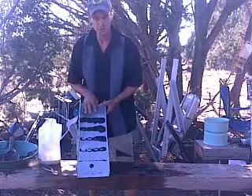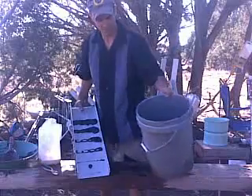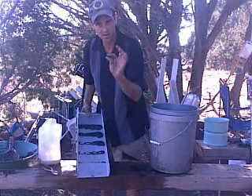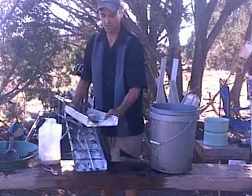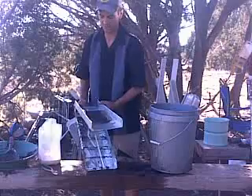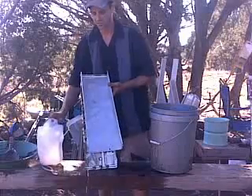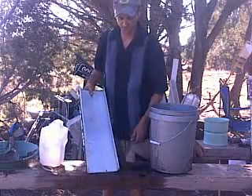This will help remove most of your black sand. The easy part: to remove that black sand and wash it out, you take the top magnet that's holding it together off, then lift the top and bottom plates from each other. You'll notice they separate and it takes very little water to wash it all clean. Typically you'd want to wash that into a bucket as your saved black sand concentrates.